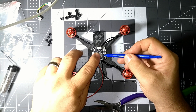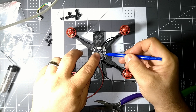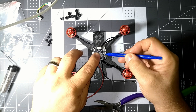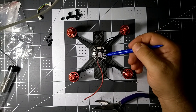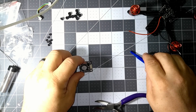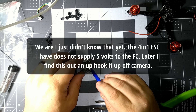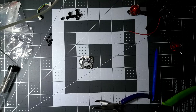We've got a ground and a ground, and then we have a buzzer - so we're going to use these buzzer pads. I think one of these grounds and possibly one of these 5-volts. So these four - one, two, three, four - that's going to be for our receiver, which I don't have installed yet. When we get around to building that we'll use those. I'm going to take this off and tin it up. Right here is the battery - battery positive, battery negative - and we're not going to use those. We're going to put the buzzer in here.